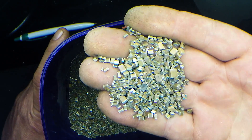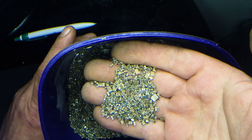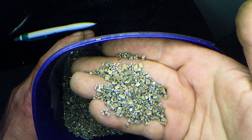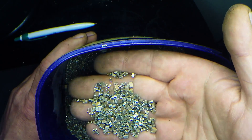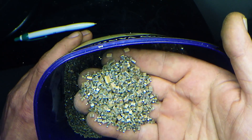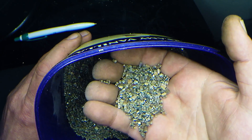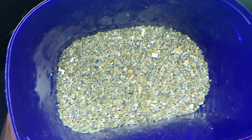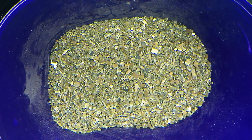What we're really chasing is the palladium out of these MLCCs — silver is something you'd go for afterwards. Assuming that all the MLCCs you pick are actually MLCCs, the recovery rate is somewhere around 2% palladium and 10% silver. So for every one kilogram of MLCCs, you should get 20 grams of palladium and 100 grams of silver — that's assuming they're all MLCCs and don't have MLCIs mixed in.